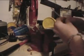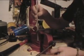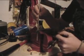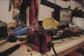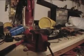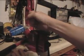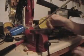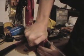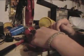Okay, so you got your vise. Take your piece of aluminum, there's my mark right there, I hope you can see it, and put it in like this, tighten the vise up, and make the edge of the vise just a little below the mark. See, that's where mine is. Okay, and now make sure it's really tight, and then hold it as low as you can and just bend it, pull it towards you. This stuff's pretty strong. And remember, for the first bend, you want to make it more than 90 degrees because it's going to be going down a handrail, if that's what you're making.